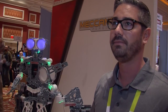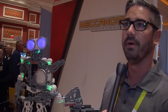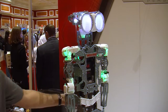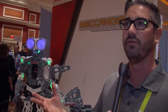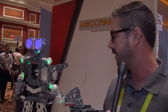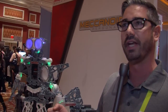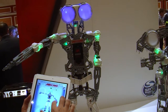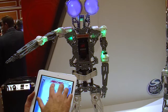Once you build these things, talk about the tablet and the programming side. On the programming side, there's three ways to program. There's what we call LIM — Learned Intelligent Motion — where through just a push of a button you move the arms around, the smart servos memorize what you've done, and it plays it back. You can also record that as a voice recognition command. Then with the app, there's two ways to program it: Ragdoll, which is an avatar mode where you move the servos on the app, and motion capture — you stand in front of the mechanoid, put your camera up on his chest, and he will follow your movements. That records the animation in an animation builder.